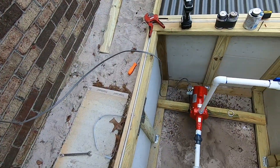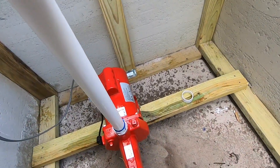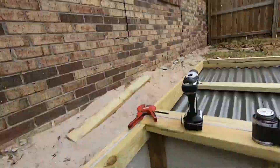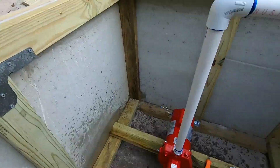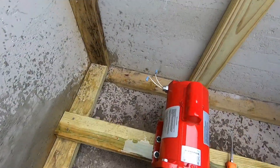This thing took a little while to get primed up. I had one of my neighbors come over and help me get it primed because it had a big air pocket — we had to take loose that plug just right there on the snout of the pump. I got the well pumped off, it runs, it's primed. This pump did come with extra plugs, which makes it nice. I've already taken the factory switch off because the valve I'm going to be using is called a cycle stop valve, and it relocates the switch to a different location up by the valve.